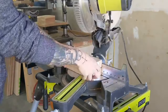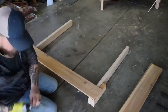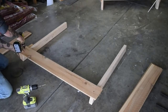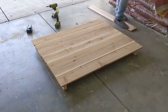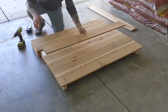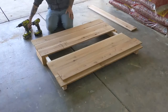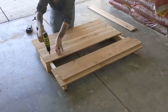Then for the roof, I cut about two inches off the end of the short two-by-fours that were cut from the four-foot seven-inch two-by-four, at about a 15-degree angle. I did the same process here as I did on the back wall — laid out the two-by-fours, placed the fence pickets on top evenly, and screwed them in. I could have put a diagonal support under the roof, but as long as nothing's going on top of this it'll be fine. It's really not meant to support weight, just keep the wood dry.